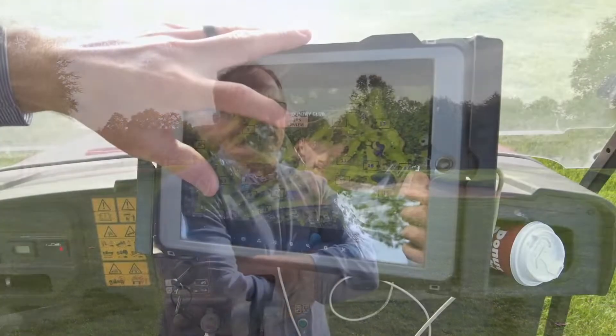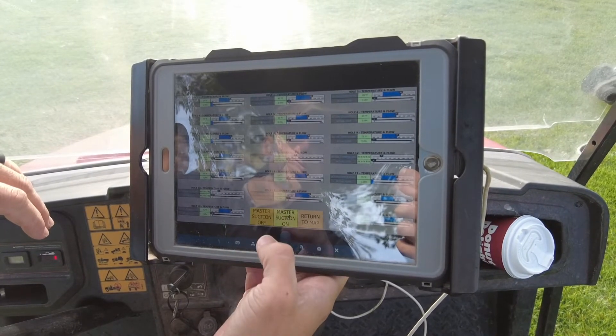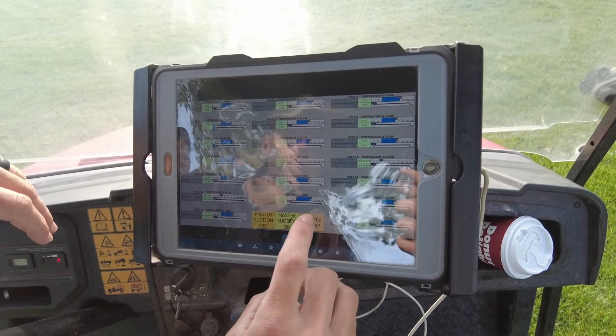What we wanted to do was take these units completely away and have their own central control system, their own platform. We did not want to incorporate it into the irrigation system and run it via the central irrigation. So we worked — it's a new system but it's old technology; it's just a PLC-based controller. It allows us to virtually do anything we want with each green, or we can do it broad stroke and do the same thing to all the greens. In terms of programming, it's as simple as writing a little logic statement — an 'if-this-do-that' type thing.